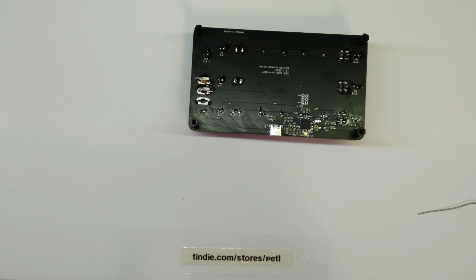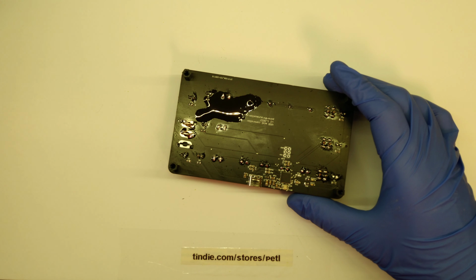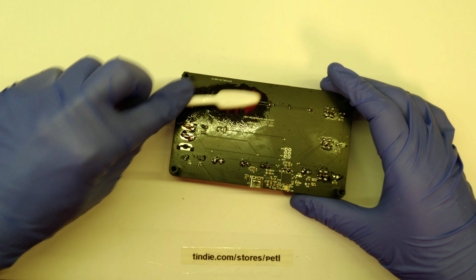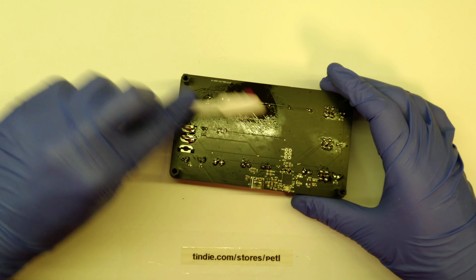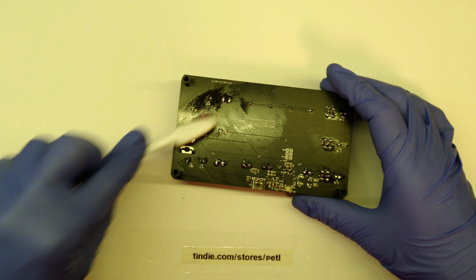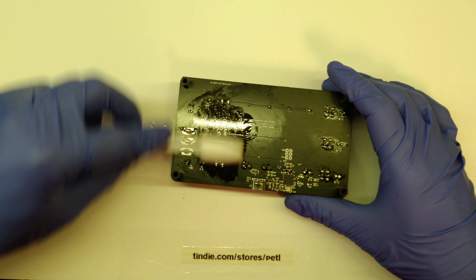And now I would say we're getting some cleaning in. Like I said, I'm normally using acetone. This is IPA. And please watch out for the acrylic. I cannot stress that too much. What I'm going to do is just try to clean off all the flux residue. So this is maybe going to take a couple of minutes. If you're watching this tutorial to assemble one unit yourself, you can now skip ahead a minute or two and do that in your own time, at your own pace, so that you don't have to watch me.